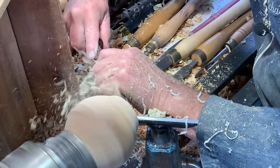And this is a 1 inch round nose. Can feel where I've got to go. Get a magnet on the top. So that gets me to within probably, I'm going to allow, I like a little bit of extra weight in the bottom of these, just because they feel better balanced. So whilst it only is just under 1/8 inch up here, I'll have it just over 1/8 down there.